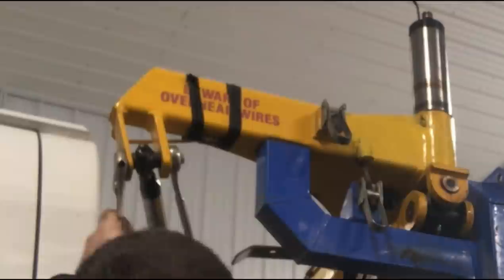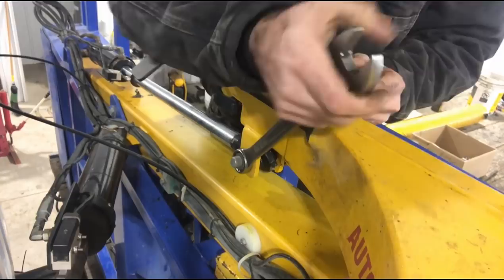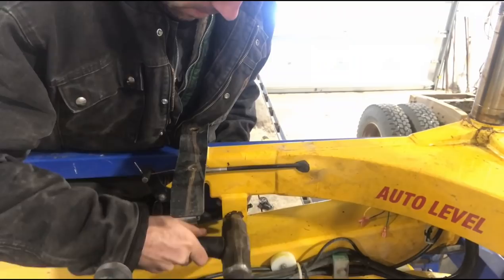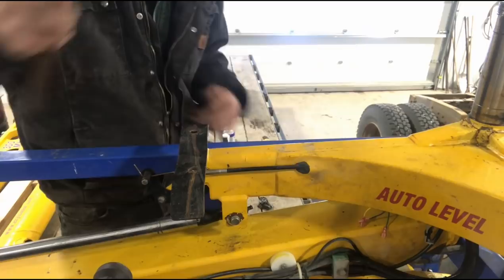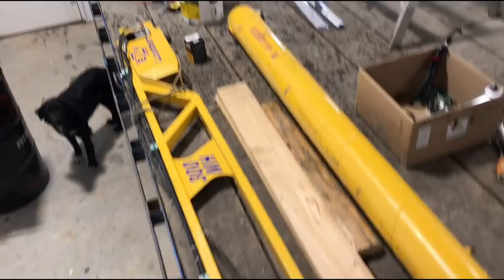The EZLoader uses two hydraulic cylinders to level out the tripod, which puts the boom in a level plane to be swung all the way around the truck. The leveling can be done manually with two switches by adjusting the hydraulic cylinders, but they also have an auto-level feature which brings the tripod automatically to a level plane. That's really nice because we're up in the hills here — we're not flat — and manually adjusting takes time. You can just press a button and it levels automatically.